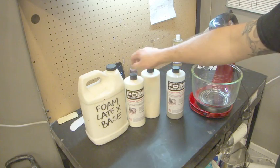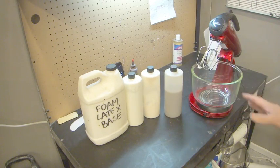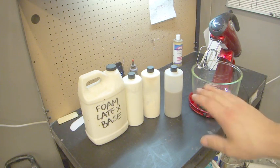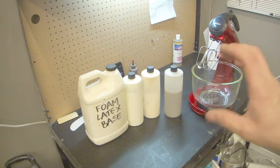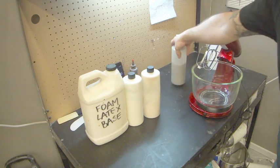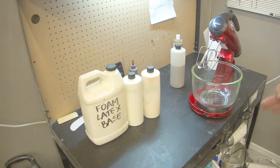If you look at typically the colors, with both the GM foam systems and the Monster Makers, the gelling agent is much darker. So that is a visual cue that it doesn't get added at the same time. There's a visual difference between those components. So the one that's darker, we'll just pop to the side because that gets added when we've finished our different stages of foam and we want to finish up and gel it and fill our molds.